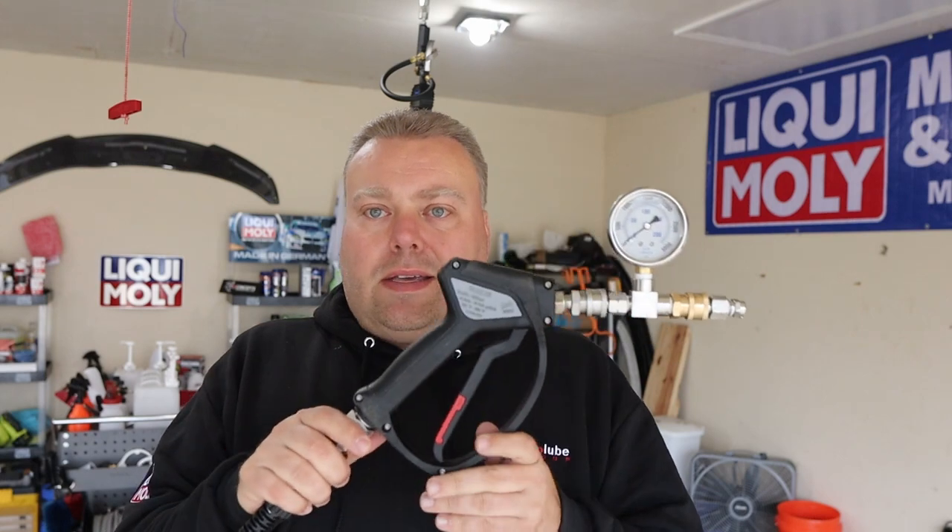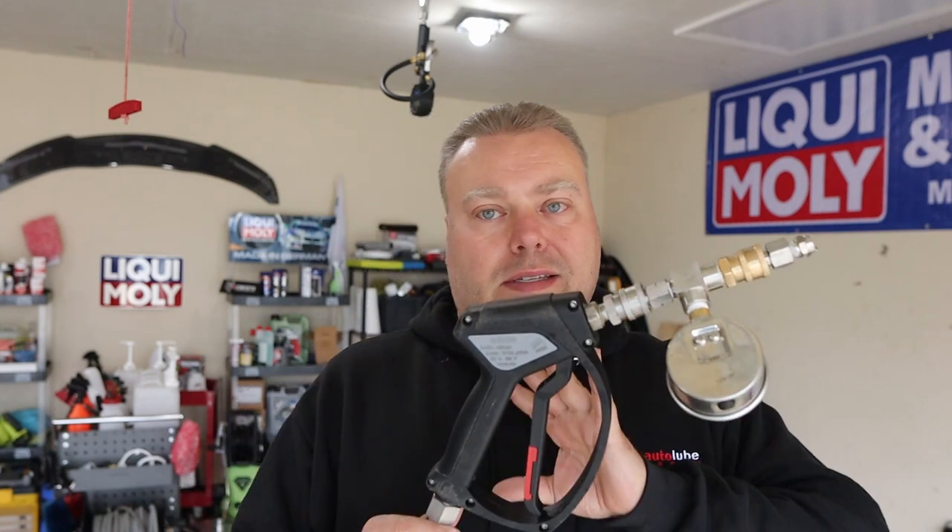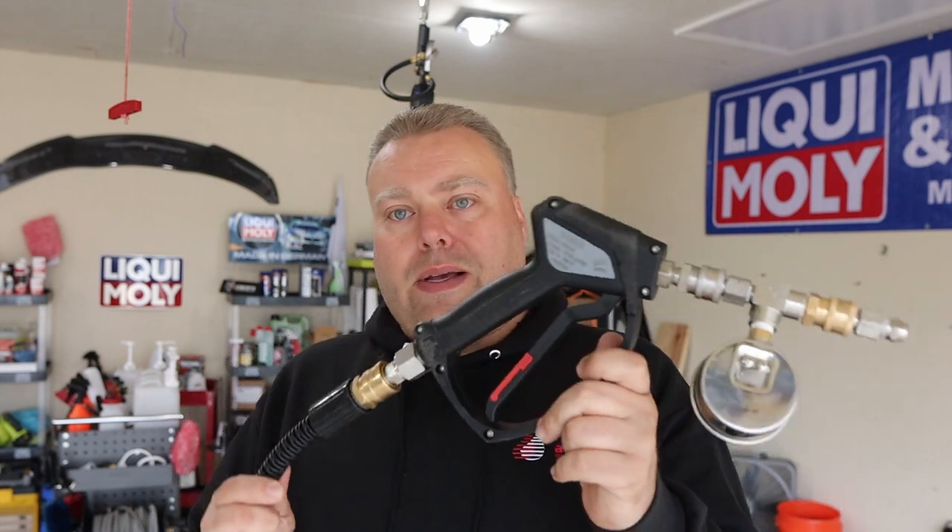So I'm just playing around — I hook up my SGS 28 gun. I have the quick disconnect set up on the unit, and I added about 50 to 75 PSI. Testing off camera, our GPM went up too on the unit at 3.0 — we were around 1.6, and now we're at 1.7. That's pretty dang good. I don't know what it is about the gun, but this is working pretty good. The numbers are still good on the other gun, but I still always suggest upgrading to a better gun.